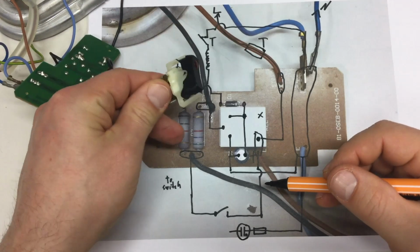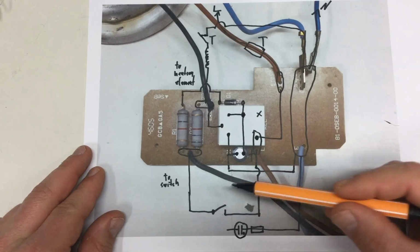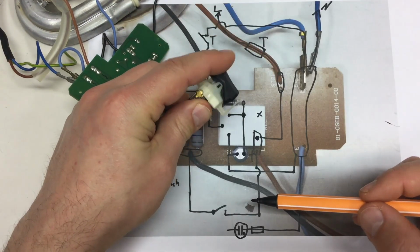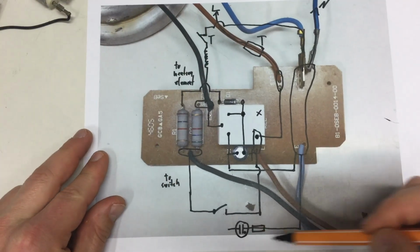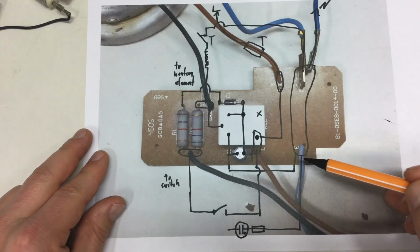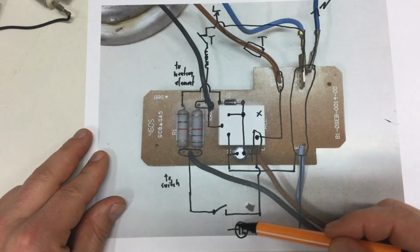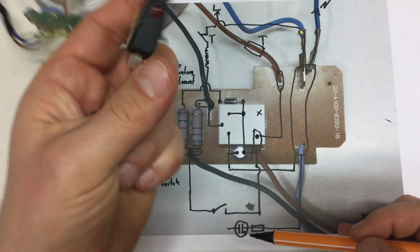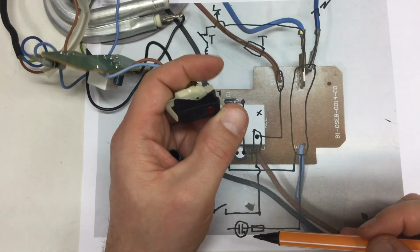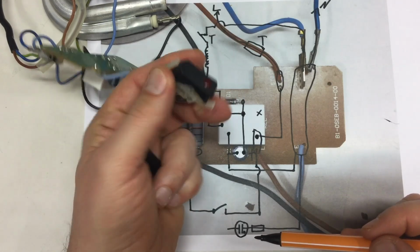Okay, and I just measured the switch, and the brown and black is momentary closed. Yeah, that's this action. Blue is basically isolated when I measured with the multimeter, so I surmise that it somehow goes to a gas discharge lamp built in here. Yeah, it has that indicator in here, and if it would be a LED I would get some reading, but I get no reading at all measuring it with low voltages.